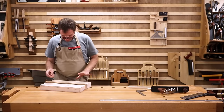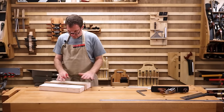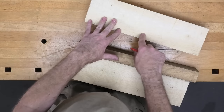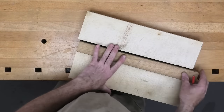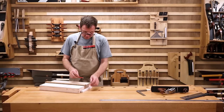Right, so we've got our three bits of wood here. We've got the sycamore, the oak, and a bit of sycamore. I can't just balance them on the bench here. We're going to actually, in reality, plane up each surface, all four sides. So any pencil marks I put on this, the chances are we're going to lose at some stage. We will add some pencil marks as we go through. So a good place that we're not going to plane up at the moment, so it does mean we can mark, we go to the end.